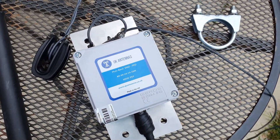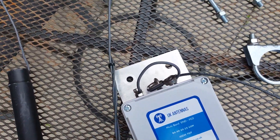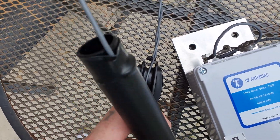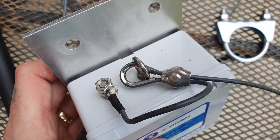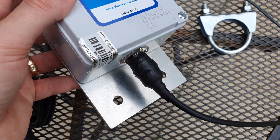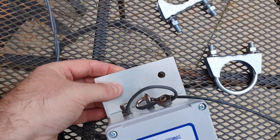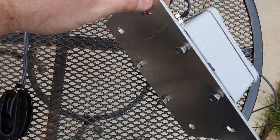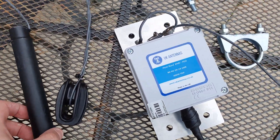Right, this is just a quick look at what you get in the box for the UK Antenna. It's all pre-done, pre-tuned. I'll probably just have to adjust this 80-meter element - it just folds back on itself. There's the insulator and there's the 80-meter coil, all really nicely heat-shrunk on there. Really nice job. And then that's the transformer - really really solid construction. It comes with the stainless clamps and the stainless back plate. So yeah, really really nice.